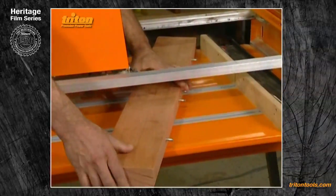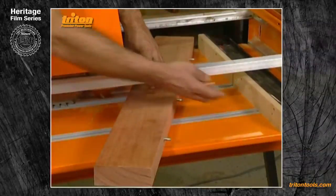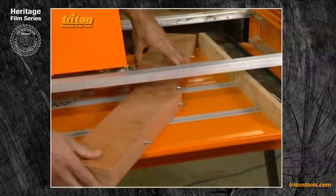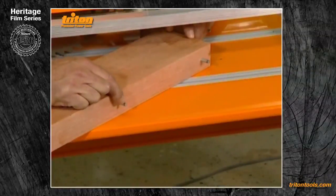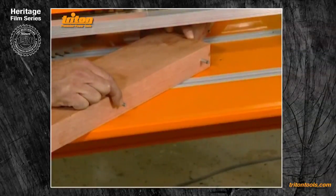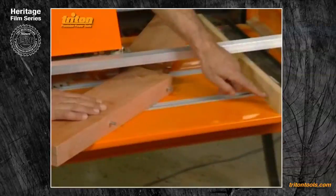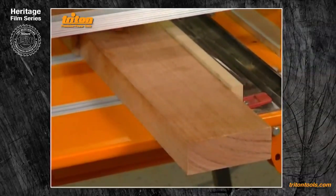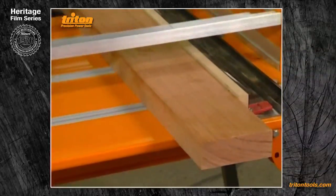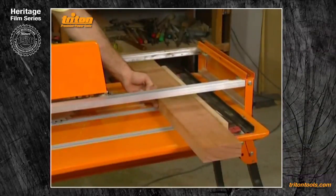These two pieces used to be one straight piece of wood, 125mm wide and about 50mm thick — make it fairly thick so you're basically replicating that face again. Before cutting them in two, drill 6mm holes at four places and drive 6.35mm (quarter-inch) hex bolts in as far as they'll go; once fully engaged and having cut their own thread, use an angle grinder to cut the heads off. Drill matching holes through the MDF sub-fences for a doweled fit of these extended sub-fences. Always check with a straight edge that both pieces are exactly in line with no step or rocking.